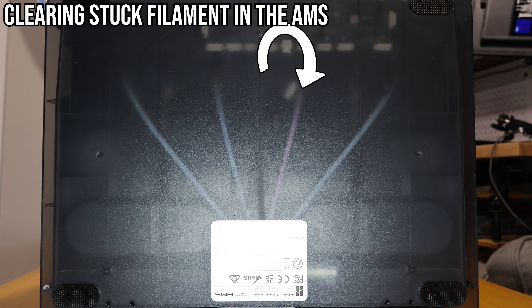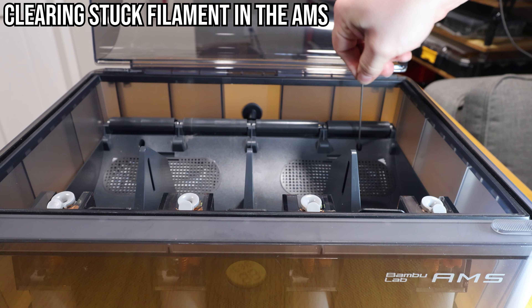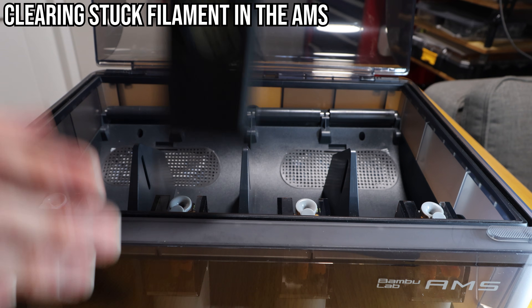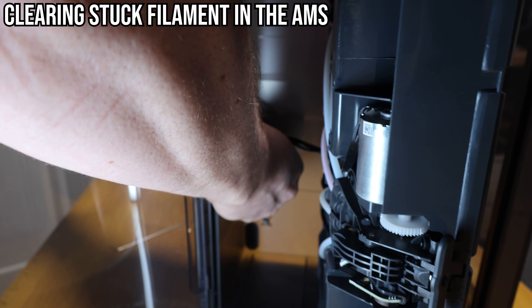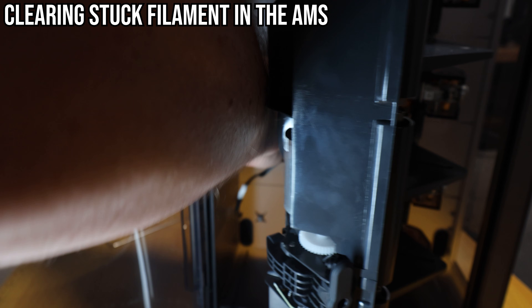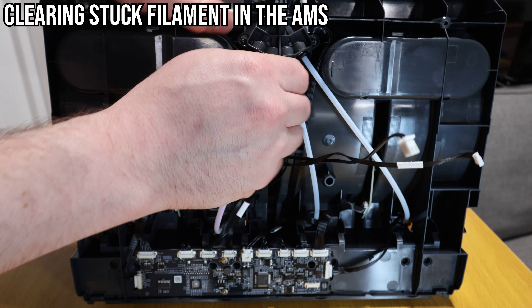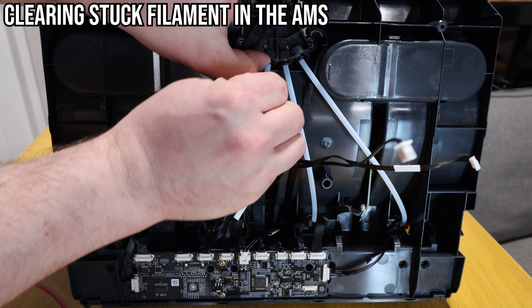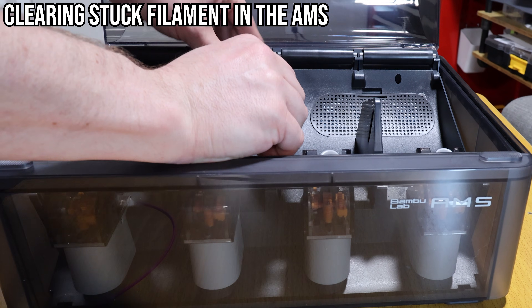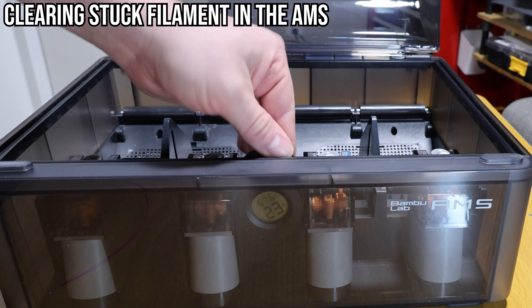When putting my printer back on the shelf, I found I had broken filament in one of the tubes of the AMS because it wouldn't stop rolling the filament — so let's fix that. To remove the AMS internals, there are two screws in the back you need to unscrew with an Allen key. Once removed, you'll have to pull two sets of wires, which is super easy without any latches. If, like me, you printed the second water-absorbing pellet containers, you'll need to remove those too. With a little convincing it'll pull right out. Then, like any other PTFE tube, you push in the connection to remove the tube and the filament can just be pulled out. Reverse this to put it back together — the wires are a little difficult because the connections are small and you don't have a lot of room, so just be careful and patient.